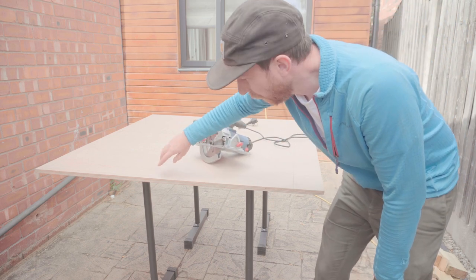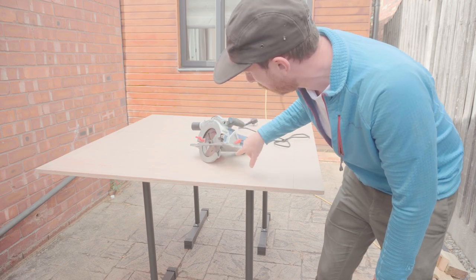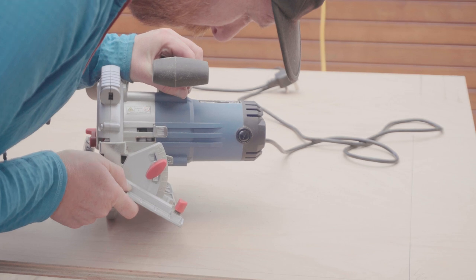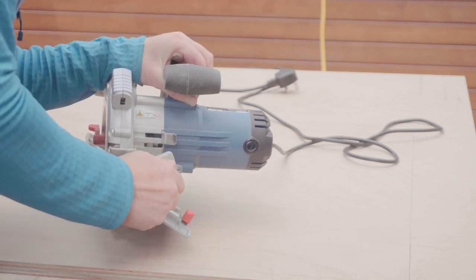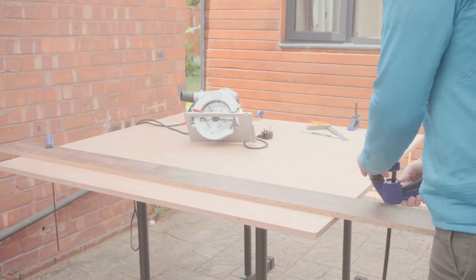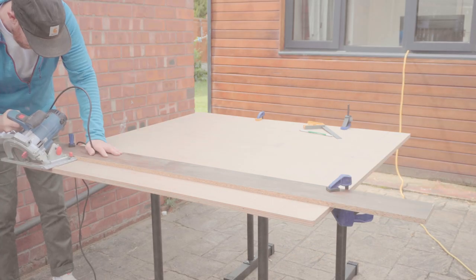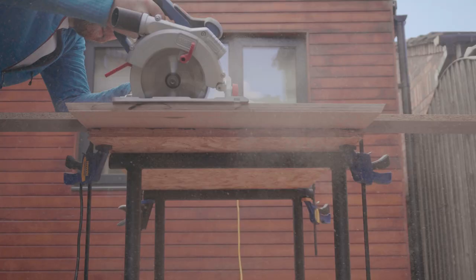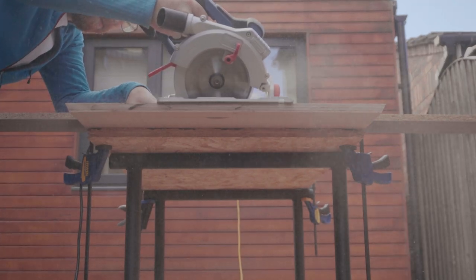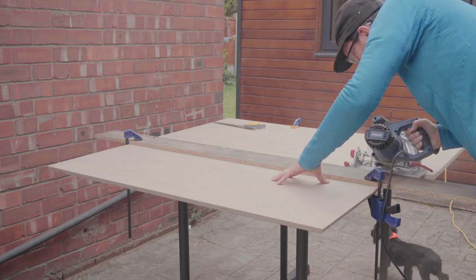For the tabletop, I'm going to do about a 30 degree chamfer on each of the sides. I'm not going to worry too much about the exact angle because it'll be the same on all four sides as long as I don't fiddle with it in between. I was really put off by the circular saw at first and I know a lot of beginner DIYers are, but it really is a great tool — much better than a jigsaw for loads of things. Just make sure you set it up well each time and respect that blade. I've got some specific tips in a short; I'll leave a link in the description.